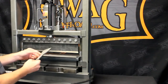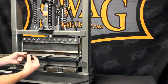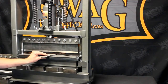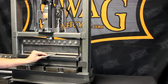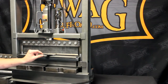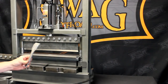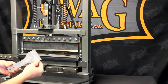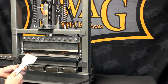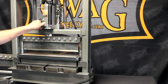We have a piece of 4-inch wide 3/16ths. This is not the best application for the flat top without increasing the width of the bottom dies, because the bottom die is only 3/4 inches wide — there's not much room for the material to enter for the top die. But let's try anyway. It doesn't like it at all; you could tell it was fighting. Common sense applies — you've got 20 tons and can do a lot of damage. So we'll take out the flat top and bend it with the stacked angle iron configuration instead.